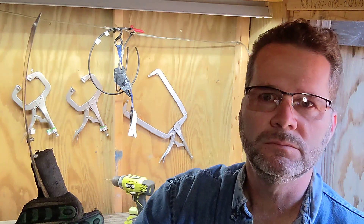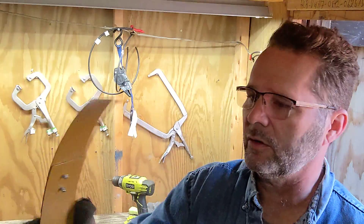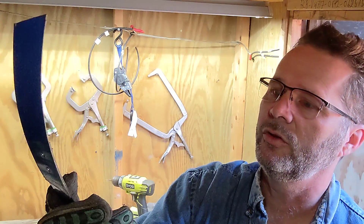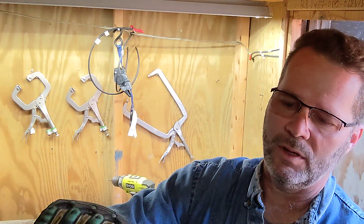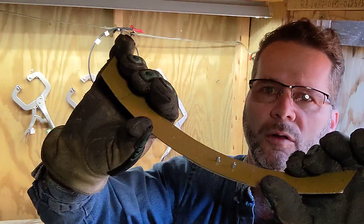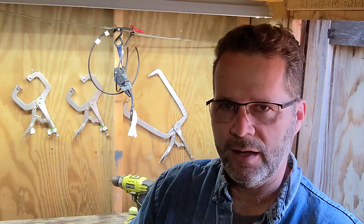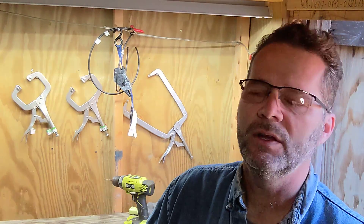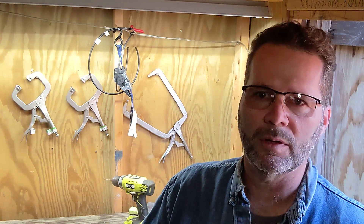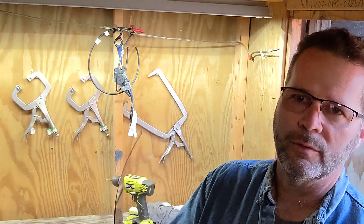If this were bare metal, then I'd say let's just spot weld it, because bare metal gives a good strong bond and it's faster to construct. But using rivets allows me to construct these and visually inspect them. I also try to make sure the nice finished side is what's exposed on the parts you can see. These are called blind rivets — the fat part that gets deformed and makes the bond is hidden inside areas where you can't see, to keep those hidden. I hope this gives you some insight and peace of mind about your fire pit — that it's going to structurally handle the extreme temperature changes. When you're picking it up and carrying it, don't worry about breaking it. You're not going to break it. These rivets have the ability to take it.